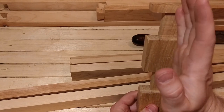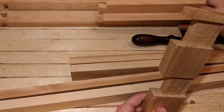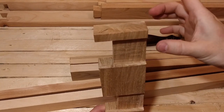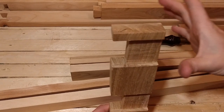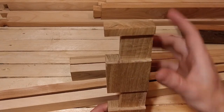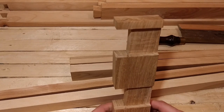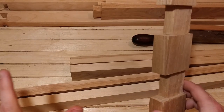When a kid is leaning against the rail, especially the back one, it's going to be holding that back rail in a mechanical joint, not just a glue joint. Whereas the second rail down, where a kid leaning back won't be on so much, this dovetail will be the opposite direction — holding the two rails on either side of the wagon together. So the way the dovetails are arranged keeps the fence post together and keeps the rails secure, thinking about how the kids are going to be leaning against them. This is the first time making a wagon, so who knows — I might have to be fixing all that next year.